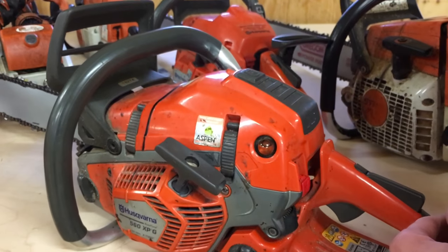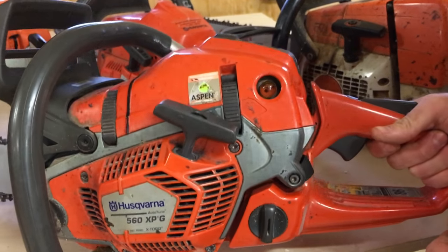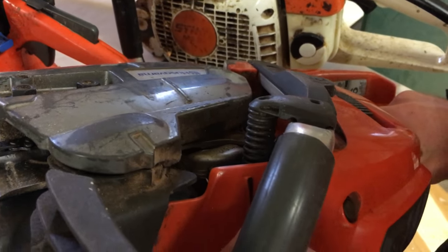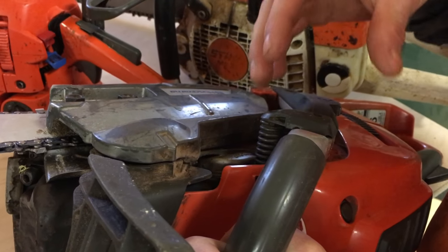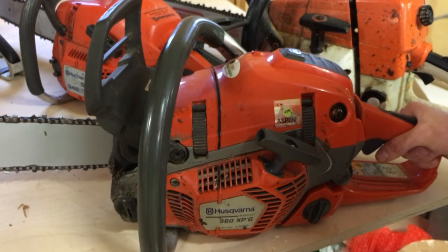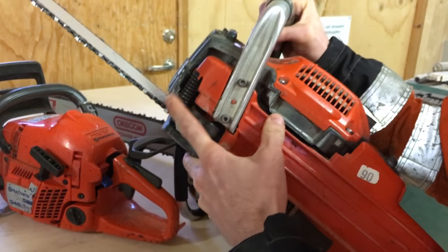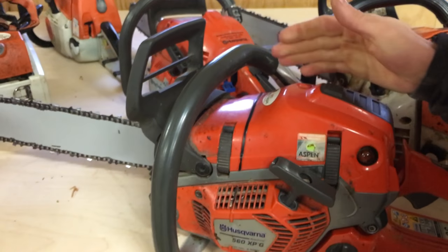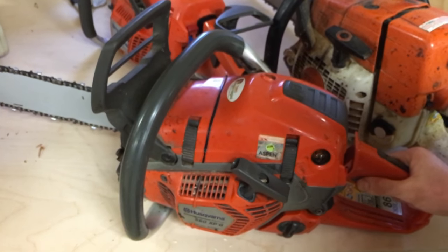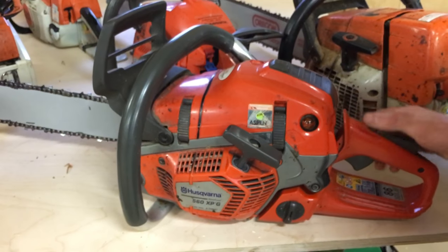There's another feature that is for your safety — not so much for a life-threatening situation, but more of a long-term thing — and that is anti-vibration dampeners. You can see them on this model; for example, here it's this spring. Both handles are actually separated from the engine part and connected really only by these springs, with no solid connection. Therefore, the vibrations are not transferred into the handles in the same way as they would be otherwise. There's one here, one back there, and one there. It's important when you do a safety check on your saw that these are intact, because if one is broken, the handle and the engine are not connected properly, your engine part feels like it's wobbling around, and you do not have good control over your saw.